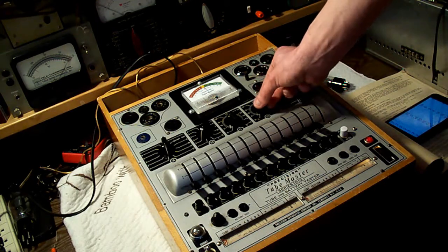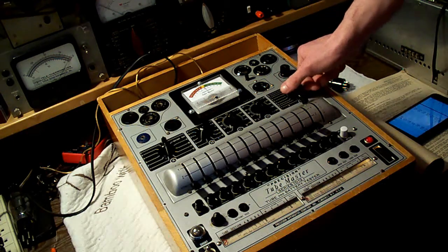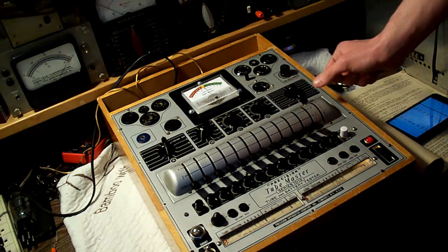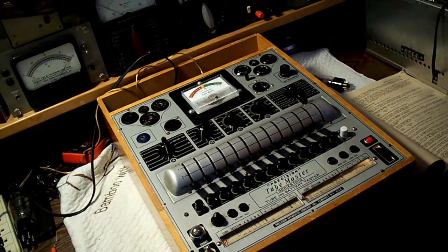Actually, the D control is 24 and the filament is on 10. Let me check — yeah, E is 10. I just wasn't sure about that because that filament voltage seemed kind of high, but it might be a little bit higher than a regular six-volt tube.